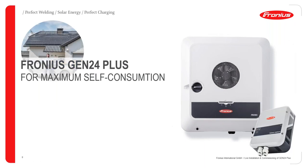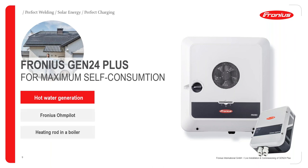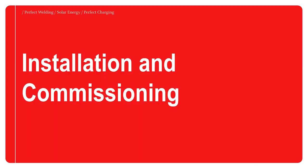With the use of the Fronius Ohm Pilot, which can easily be integrated into the system, you can generate hot water. This is achieved by conveniently using surplus PV power to supply a heating rod, which means we can generate an efficient storage solution using excess energy that would otherwise be fed into the grid.